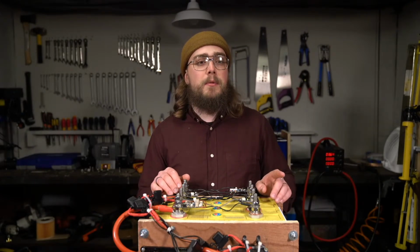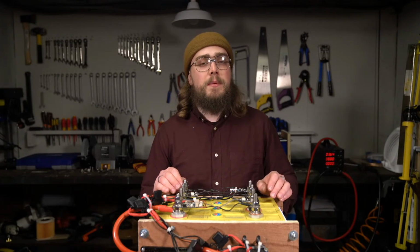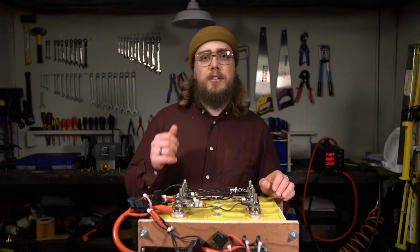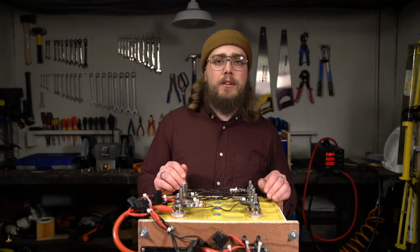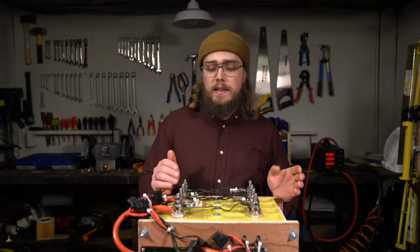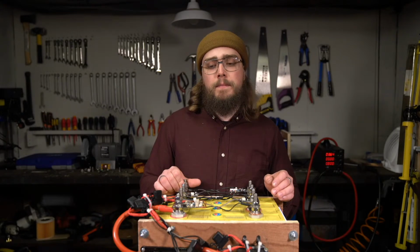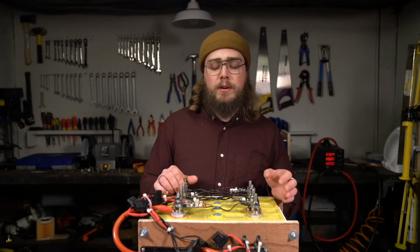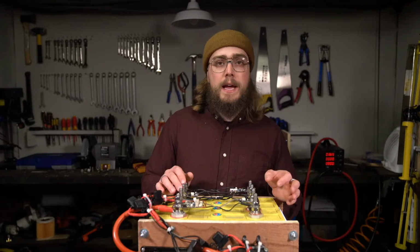So I actually have a 2 kilowatt inverter in my van, but I never use that full capacity, because I pretty much don't run anything that needs mains electricity. All of our charging is done on USB, so tablets and phones are all charged with USB. Obviously all the lights run on 12 volt. Our heating system is gas, just LPG, and that uses 12 volt to ignite and has some fans which are all 12 volt. Our stove is all gas. Fridge is gas or mains electric, but mostly runs on gas. So we use very little mains actually.